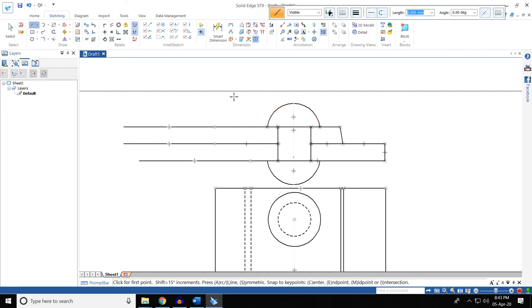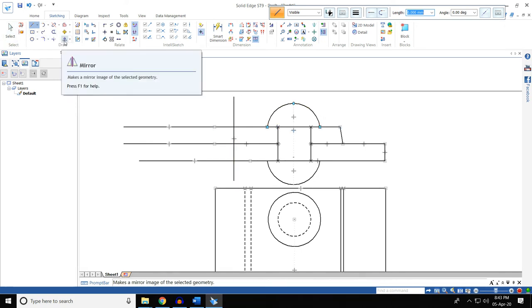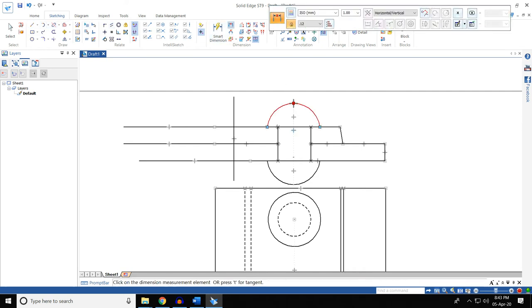So we know the distance between two rivets, the pitch, is about 3 times of the diameter, correct? So what we'll do, we'll place this at 3 times the diameter, which is 54. 54 half is about, how much would it be, 24, no. We'll do 54 by 2, sorry, 27, okay.